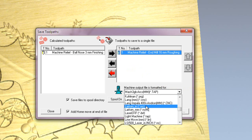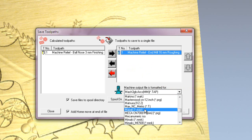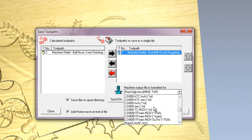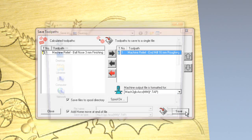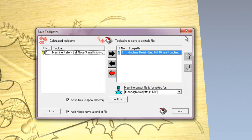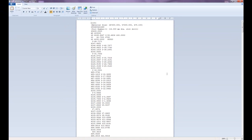You can see all of the posts available in ArtCam — there are over 300 posts available within ArtCam Express, the basic version. You don't need anything else. There is also a generic G-code which you could try if your machine isn't listed. Quite a few people use that just to get the machine running. I'm going to save this as a Mach 3 G-code, save that onto my desktop, open the file, and there you can see the G-code ready to be sent to the machine. Thanks for watching, Merry Christmas and a Happy New Year!